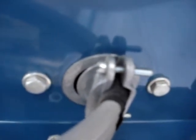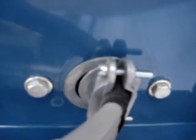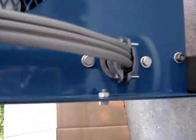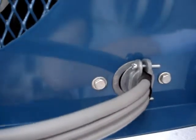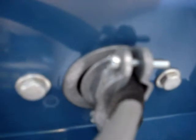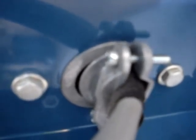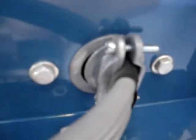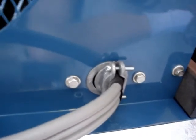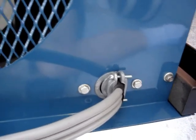I don't know if you can see it — this camera kind of likes to hunt. This is the cord that came with it, which is only a 50-amp cord — it's a range cord. I got some 6/4 SO cord which I may put in there, but it only requires three conductors since it's a single-phase machine.